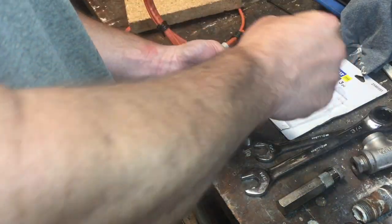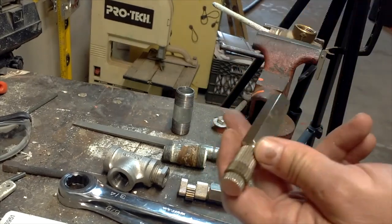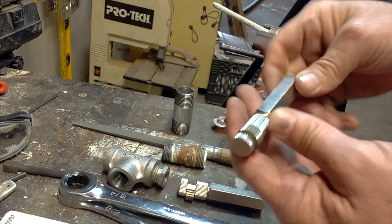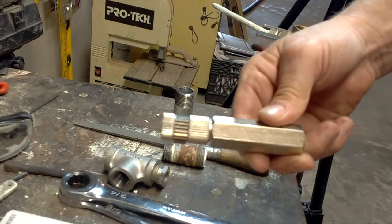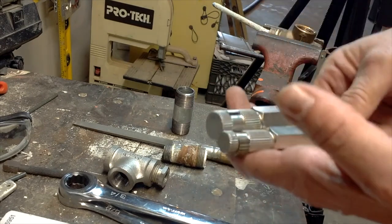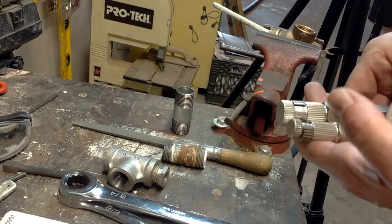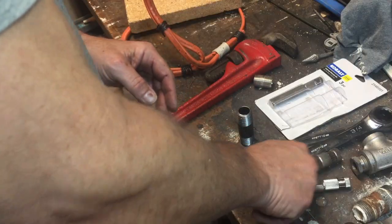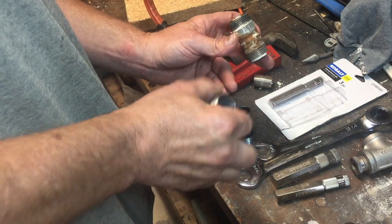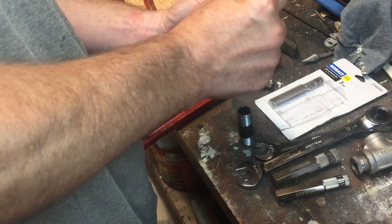If you're going to break it, using jarring force would probably snap that shaft. So use nice even force — don't go hitting it with a hammer because it might break. These are fairly heavy tools. It's Chinese-made; I can't swear to the quality — I've owned a lot of cobalt tools so your guess is as good as mine. I had a dip tube on a water heater and to get it out you had to put a pipe wrench on it because it's basically a close nipple.